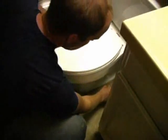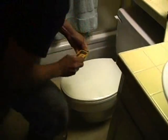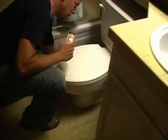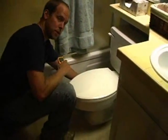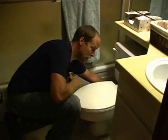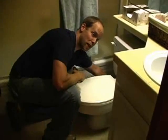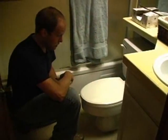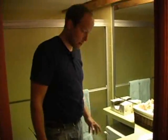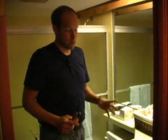Yeah, definitely, for sure. And it's not a leak from the tank. I made that mistake before. You know, the tank has bolts underneath, rusts out, and it can drip. There are no rust marks on the carpeting, and there are no drips in those two areas. And it's not the water valve. I usually just put my hand underneath each valve, even underneath the bathroom sinks. So this toilet needs to be pulled up by a plumber and the wax seal replaced. And that was all done actually very quickly, within a second or two, with the infrared camera.